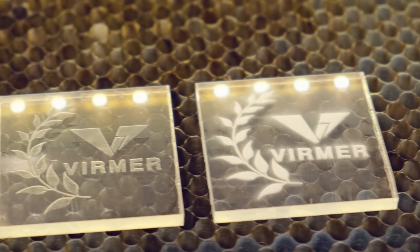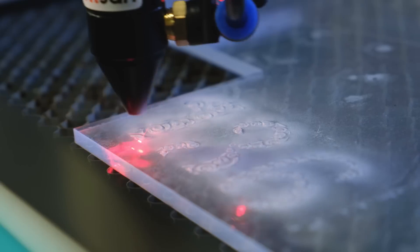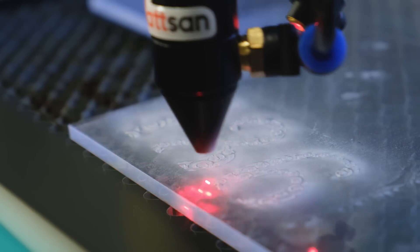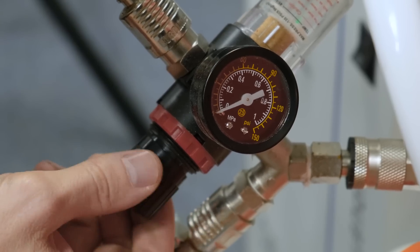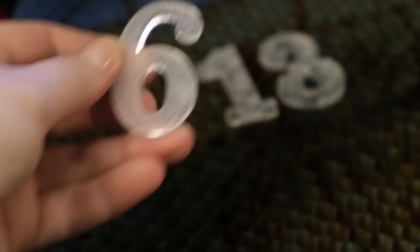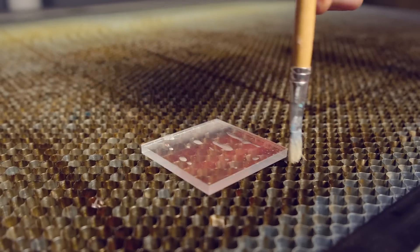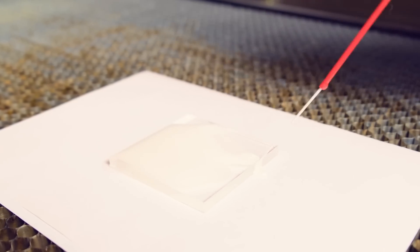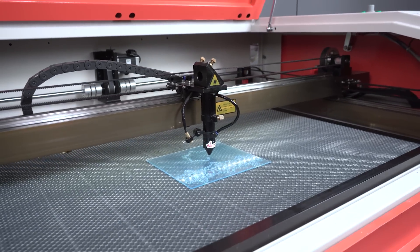These are four main methods of engraving acrylic. Let us summarize. When engraving with blowing we get a white mist-like haze on the image. With minimal blowing there is much less white deposit, but it is impossible to fully avoid it. If you want a clean engraving without residue, use soapy solution or WD-40 — but remember that the product must be small. Choose the option that suits you best.